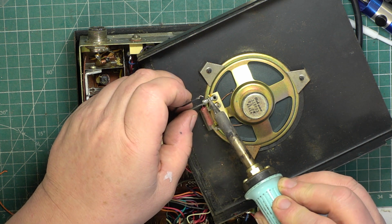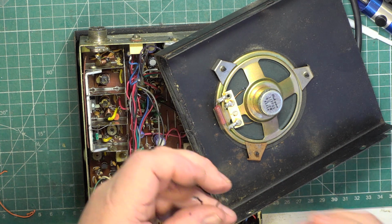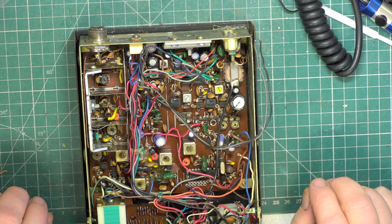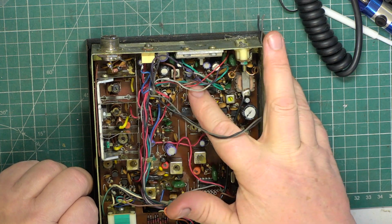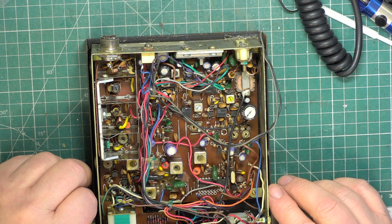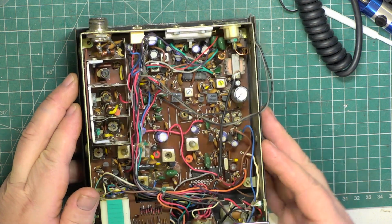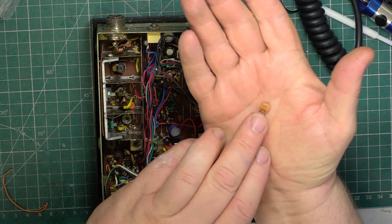It's all tatty, that wiring, so we'll cut it short. There's no circuit diagram for these sets that I'm aware of. It uses an LC7137, so there aren't really any surprises. Why somebody put a crystal filter in it? Well, that can stay, although we specialise in doing OEM, original equipment manufacturer repairs. As long as that's not wrongly done, in other words, when I test the receiver, as long as it works to a satisfactory level, that can stay put, rather than the ceramic type of filter, which is this type of thing. If you can actually see that, I should have different colour hands, shouldn't I?